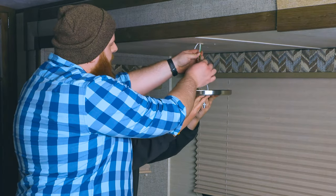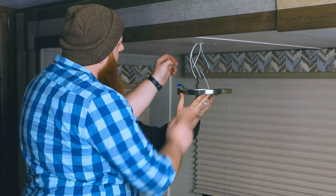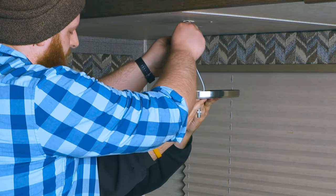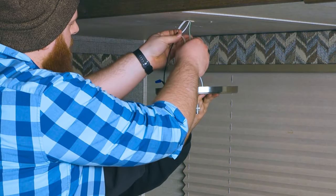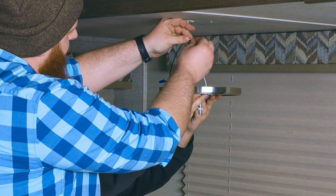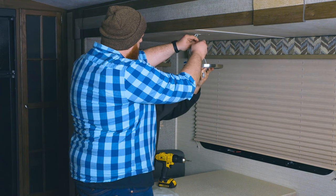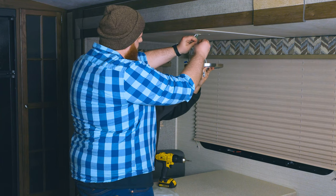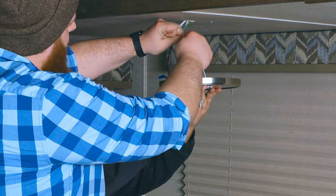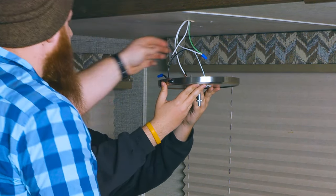For each pair of cables, we've got a ground wire, which is going to be the striped one, and then we have a hot wire, which is going to be the non-striped one. We're taking the black wire and wiring it to both of these striped ones with one of these wire nuts. We're going to pinch these pairs of cables together and then get the wire for the light in there. Slide the wire nut on top, getting them twisted to start a little bit makes it easier to install. Keep twisting until it locks in place. That first one's done, go for the second one.